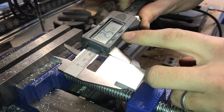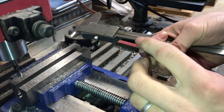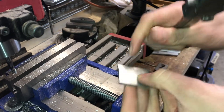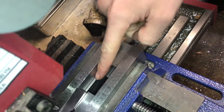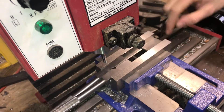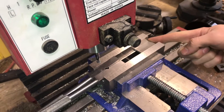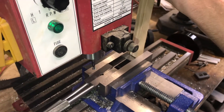After the finishing cut you can see that we are pretty close to the 25.4 that we were shooting for. So the next thing — after deburring this edge — I'm going to face this edge and this edge, making sure they're smooth and perpendicular to this edge and perpendicular to that face. To face this end off I have it laying down on two parallels in the vise. That will cause this to be parallel to the vise in this direction, which makes it perpendicular to this side. And because this vise jaw is perpendicular to the table, it should make this side perpendicular to the sides that are touching the vise jaws. So everything should be squared up, but first it's important that we seat it.